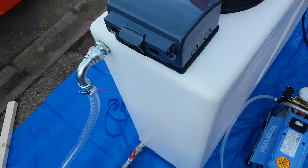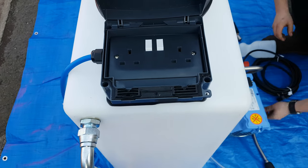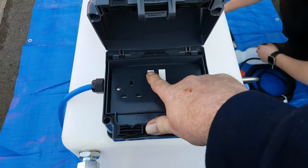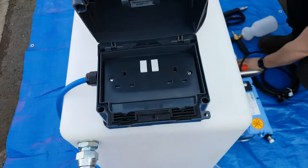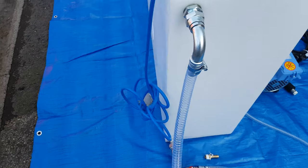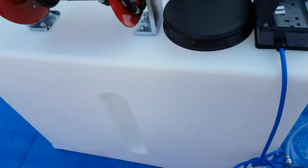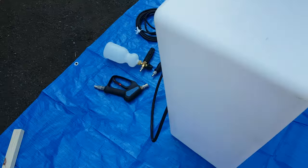We've set it up here with a plug on the top — double socket setup — so you can connect up the pressure washer and plug it in at that point. If this is at a side door, you can leave the machine turned on, have your vacuum, and control it via this switch. There's a 3-metre cable with 2.5 mil cable and a 16 amp blue socket. This is the full setup — it's ready to go straight into a van.